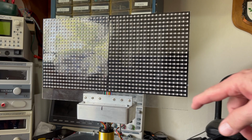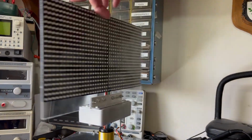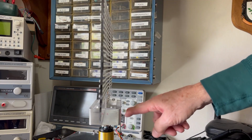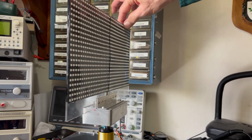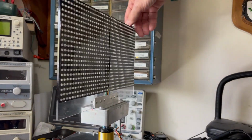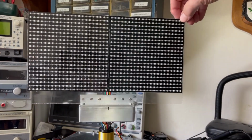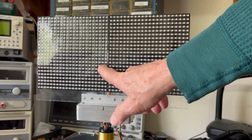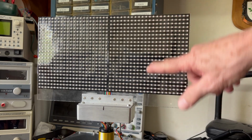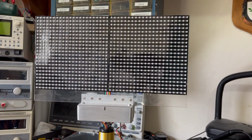The way I do that is I specify an angle, which represents the point in rotation at which I want the display to occur, relative to the Hall sensor, which is over here. So this is angle 0. This would be 90 degrees, 180 degrees, 270, and once again back to 360. So I specify the angle, which says at which point in time I flash. I specify the radius, which is the distance from the center of rotation, and I specify the height, the z. By those three coordinates, I can light any LED at any position in time.